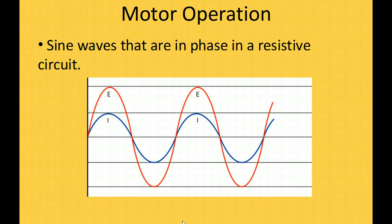What we have here are the sine waves that represent the voltage and the current of the power coming into the motor — what would be coming out of the field wiring and disconnect box. For this example we're using 100 volts and 10 amps. We get our power from the combination of voltage and amperage. When they're both at their peak, we multiply 10 amps times 100 volts for 1000 watts of power — that's what you want, voltage and current in phase.